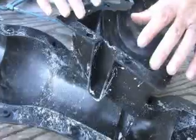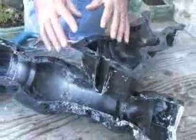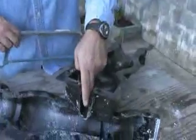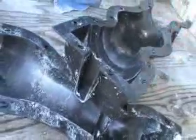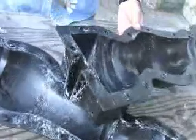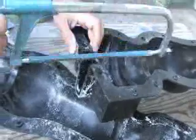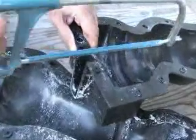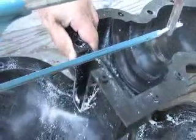Now, this is the toughest area for the mold to flex because it's tied up here. So some of my customers who are in production, they cast 40 of these a day. They recommended to go ahead and cut the mold in this area. This way it will flex open on you. So I'm gonna show you what to do if you are not patient about taking the time and cutting them. So what you need to do, you need to take a hacksaw and pretty much start here by cutting into it. And you don't have to go all the way back, and we'll see how it will flex after.